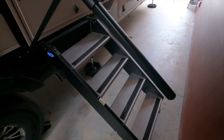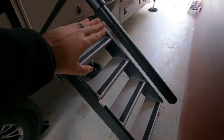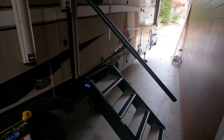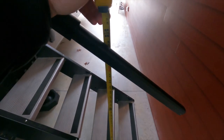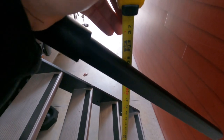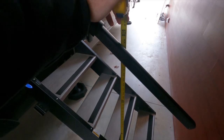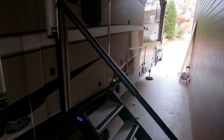Lining up the camera to the stairs, you can see there's just a little bit bigger gap at the top of the handrail compared to the bottom of the steps. So the handrail is not adjustable, but they did design it to be parallel to the steps. Basically we've got a handrail that is almost residential code compliant — just under 36 inches to the top of the railing, needing just an inch more to qualify, and it is already uninterrupted from bottom to top.